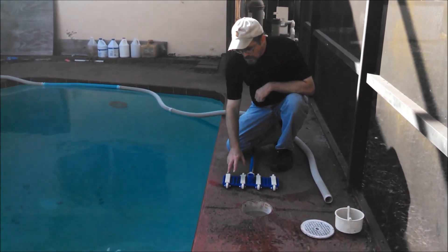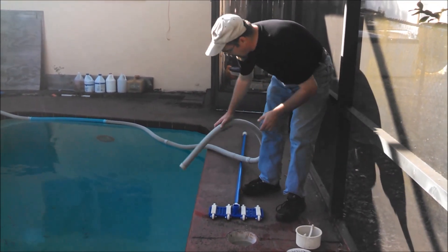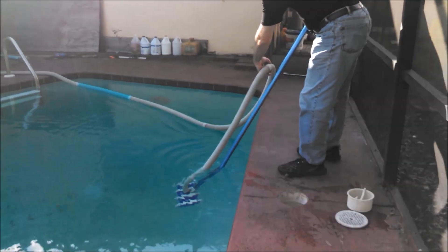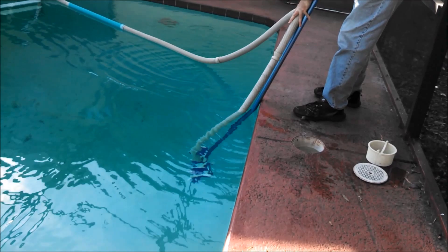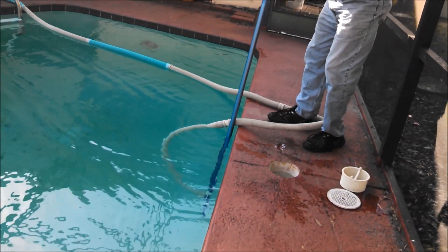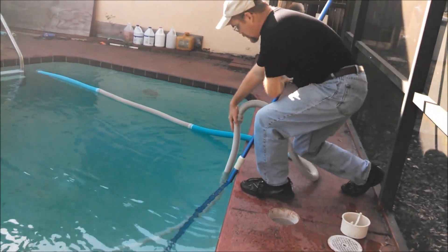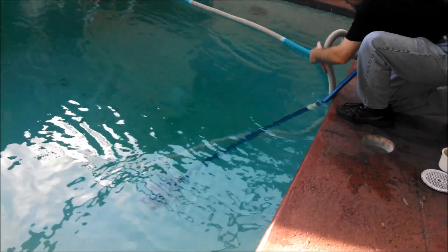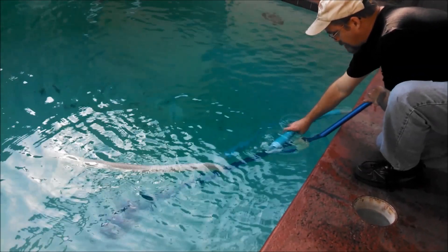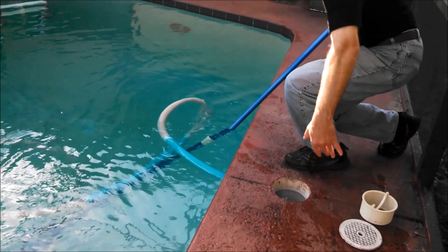Now it's time to vacuum. What you need is a vacuum head, a pole, and your hose. Go ahead and take the skimmer basket out, get that in there, put it into the hose on the vacuum head, and drop that right down in there. I don't want the hose to kick out towards the pool, so I hook my foot around it like this, which gives me control of the hose. Extend it, then drop that down in there. Feed the hose into the water until water comes up through it, then go underneath — don't go over the skimmer, go under it — put that in the skimmer, and you're set to vacuum.